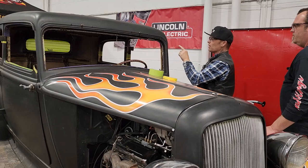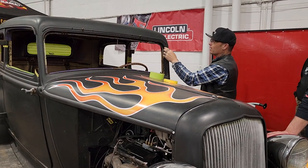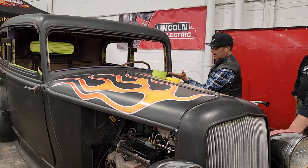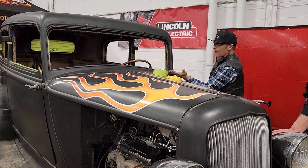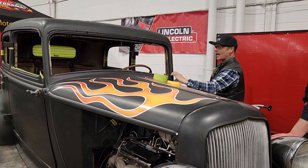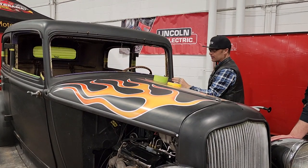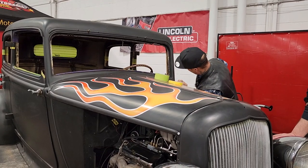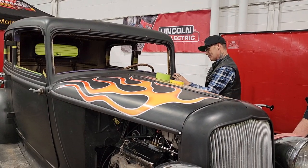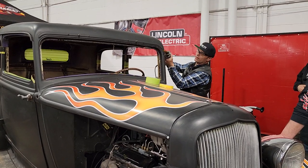Okay. So what I'm going to do is pick right underneath the drip rail. It's going to get into the round part a little bit. But when I take this post out and cut this post off, we'll take the length off the bottom instead of here. So we'll weld that back on and put this back on here after. Alrighty. Made the decision, I guess.